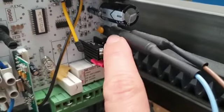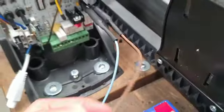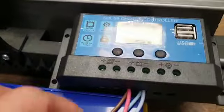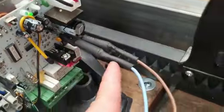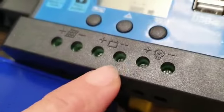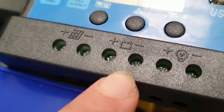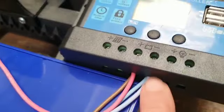You can wire from these two connectors, but you must be sure to respect the correct polarity — check it in the manual. As you can see, the plus terminal is here, so the brown cable in our case is plus and must go to the plus on the battery charger. The minus, in this case the light blue cable, goes into the negative of the battery charger.